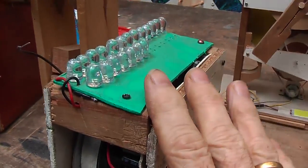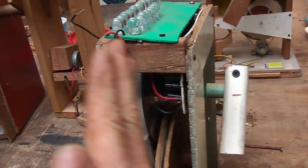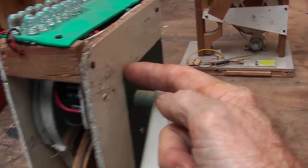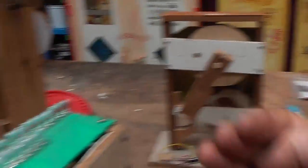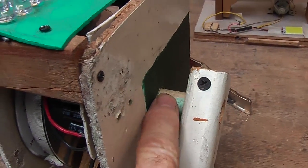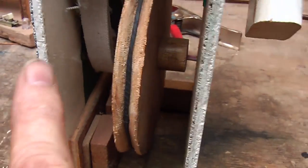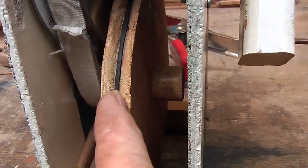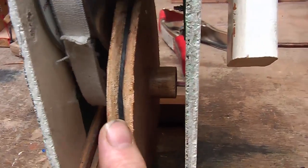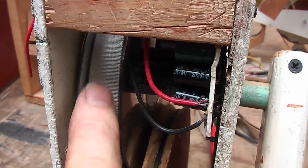This was the next version I did and it was quite a bit of effort to get this far. I changed the structure to have two side panels separated by sticks, which was a lot more efficient, because then the same sides could become just two single panels — a lot easier to make. I replaced the shaft on the main crank wheel with a piece of pipe, which did improve friction reduction. I used a car tire inner tube piece for the belt so I could get away without tensioning it — the rubber band gave me the tension — but I continued with the elastic main belt, which was not good.